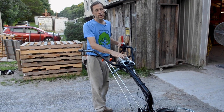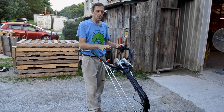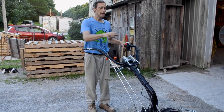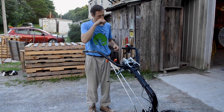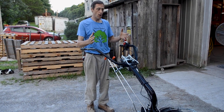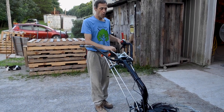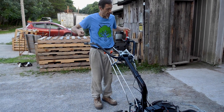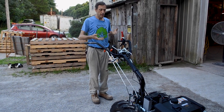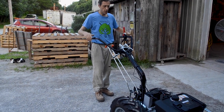These are not in a terribly convenient location for mowing. It's one of the many reasons that the G131 is typically not used for a lot of mowing applications: these brake levers being up here makes it kind of inconvenient to reach up here and pull those brake levers to get the thing to steer. For soil working applications, that style of brake can work pretty well, because when you get to the end of the row, you can clutch it to stop it. If you want to turn this way, pull the appropriate brake, and when you lift the tiller out of the ground and let out the clutch, it just turns around. The only effort you're putting out is holding the tiller up out of the ground. When you get lined up with where you want to go, you can just reach up and slap the brake off, and poof, the thing starts going forward again.